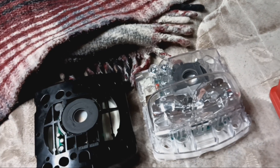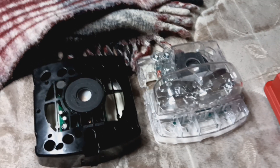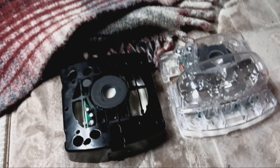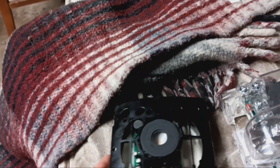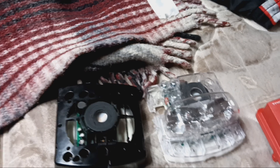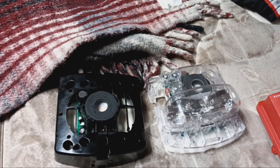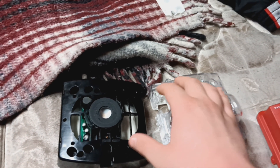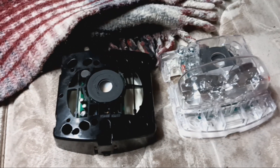That's a great way to synchronize all the strobes in a public setting on a live active system. However, they are not the most user-friendly if you don't have the proper SCM to run that way. The same thing goes with the horn if it's on SmartSync position — except that it doesn't have the strobe, so it's not going to charge anything; it just won't sound if it's flicked. As long as you have the SmartSync switch in the free-run position, you don't get any real handicaps.